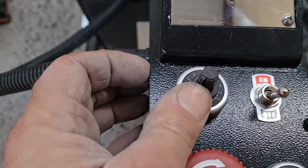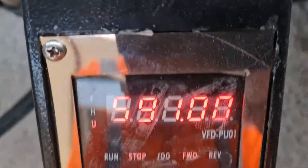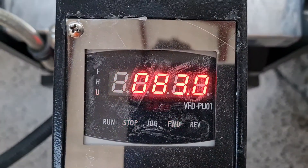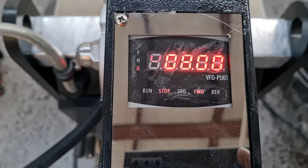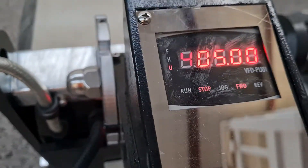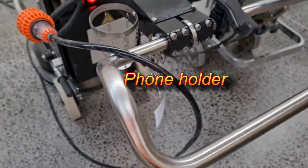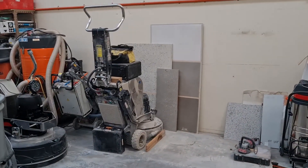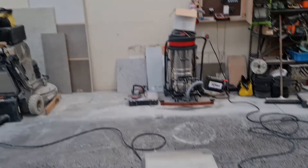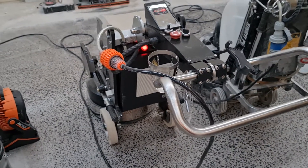On the new model you can adjust it to show the current speed. This is your motor speed adjuster, and unfortunately it's phasing with my camera. It will do up to 1500 RPM and down to about 400–405. There's a little drink holder and a camera holder. I ordered mine with the bail handle because I've had that on my 680 and found it awesome for running the vacuum hose through and also the power lead, so it keeps them away from the wheels and you're not getting bound up.